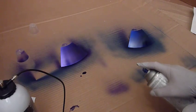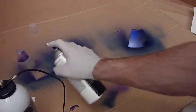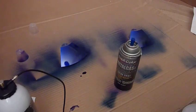So time to turn my second purple sample, I guarantee you it is purple, into something blue. Right, that's all it needs. Now it's blue. Really what the blue anodized does, it doesn't contribute much to the color, except it prevents, for some reason, the Dykem from turning purple. So it prevents that annoying color shift, and it remains pretty blue under all situations. It's also a paint, so you can see it's way more glossy once you apply it. So it's really a nice combo, those two.